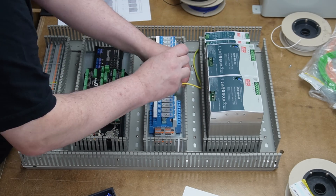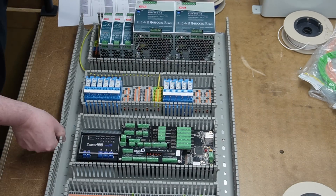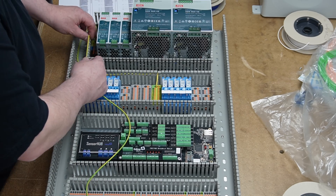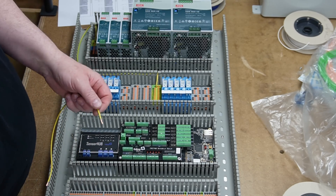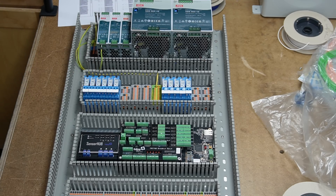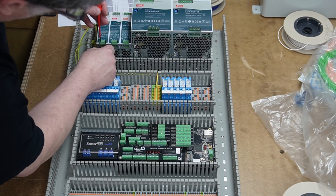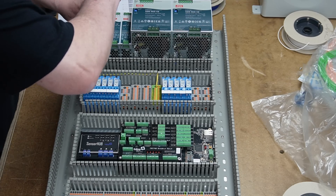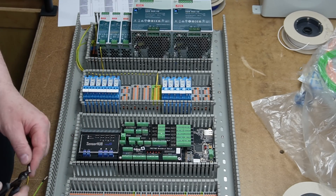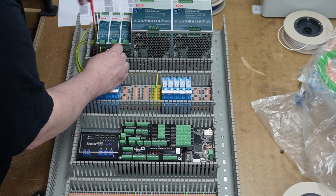As I have shown in the last video, I always try to have a flow in the controller cabinet from high voltage to low voltage components and from power input to machine connection interface. I do this mainly in order to have a cleaner wiring and as little crossing of wires as possible, especially between the AC power lines and the DC signal lines. That's why I have in this build the 24V PSUs for the controller and the 48V PSUs for the servos on top of the controller. This placement is not 100% ideal because the AC power lines are now in the same cable duct as the 24V lines that control the relays, but it is not too critical because they are well separated to each side of the duct without any direct crossings and the relays are not really sensitive anyway.